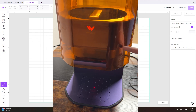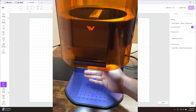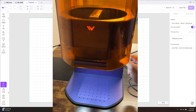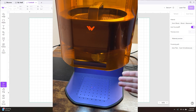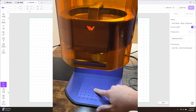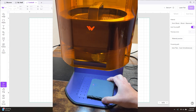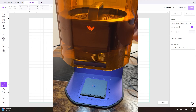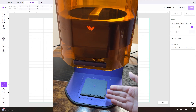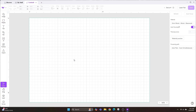You can see it's auto-focusing now — it moves the laser head up and down. You'll see two dots, and the higher that head goes, the two dots get more separated. You can control that with the dial on the right-hand side behind the machine. Those two dots have to touch each other to be in focus. You don't want to focus them on the plate itself; you want to focus on your material. So we'll drop this slate coaster in place and lower the head with the dial until those dots touch.